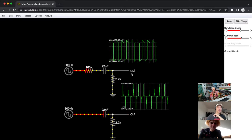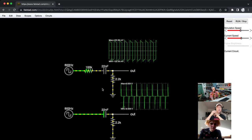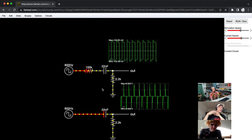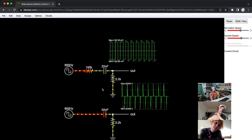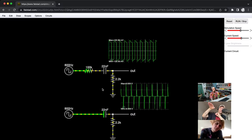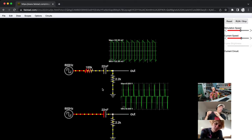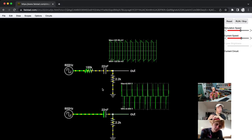And the way that this works is that if you add in a resistance before the high pass, you allow the low end through. It's like a shelf filter, like when you use a shelf filter in your DAW. It's a filter that doesn't cut off, but instead goes into this shelf section. For a high pass, that would be starting here, letting a lot of frequencies through, dropping down, but then instead of going through zero, it just straightens out again. And so it allows low frequencies through, but in an attenuated way. So you can see this here, the low end goes through, but it's very quiet basically. Does that make sense?